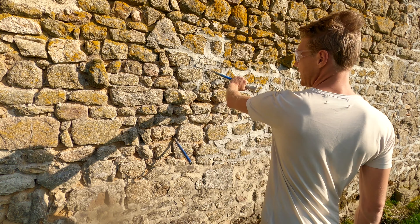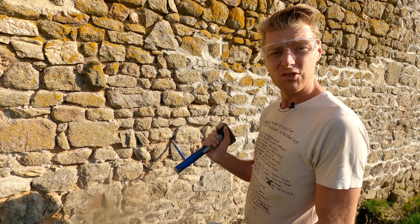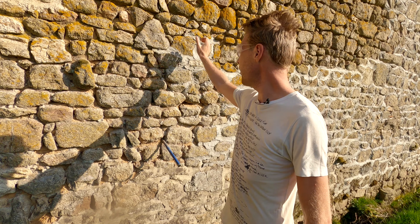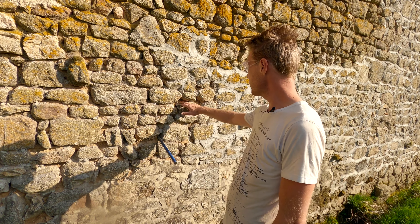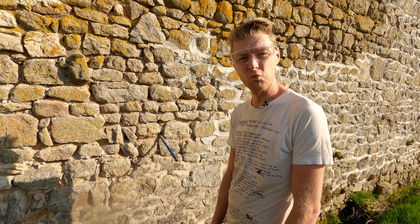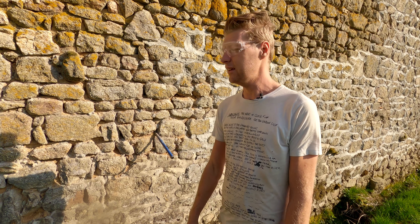You just want to go on an angle as much as you can and just tap, tap, tap away. And slowly but surely you'll get rid of it all. This stuff is horrible and you see it so much on buildings. But lime mortar is absolutely fantastic stuff — as crumbly and as weak as it seems, it's actually far better than cement at holding buildings together. And Meriem is now going to show you how we actually replace all of the old pointing with lovely brand new pointing, because it's lovely stuff and Meriem is far better at it than me.